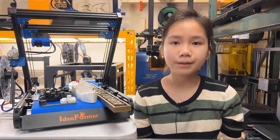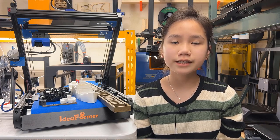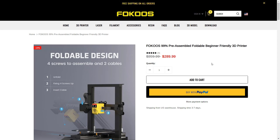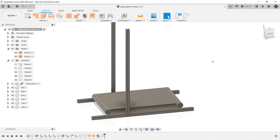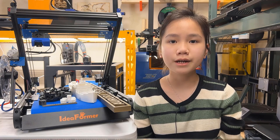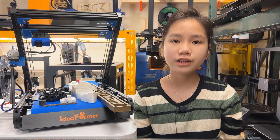The second one is a big one, as all 45-degree belt printers are not as easy to use as regular 90-degree printers. For some models, it may not be able to print as well as a normal 90-degree printer. So, I would suggest making a foldable gantry with a set of hinges, as well as an adjustable printhead angle and two different firmwares for the user to switch from 45 or 90-degree mode using the screen menu depending on what they need to print. So, this design can take advantage of the infinite Z-axis conveyor belt to print long models and the easy-to-use and better print quality of a regular 3D printer.